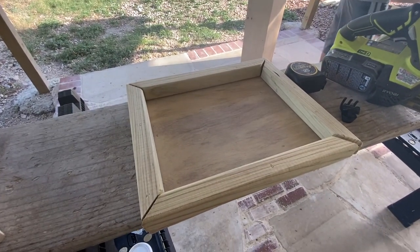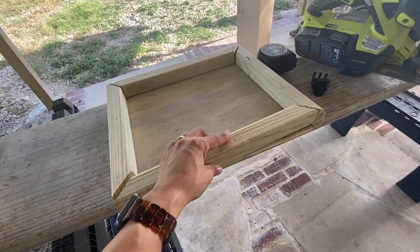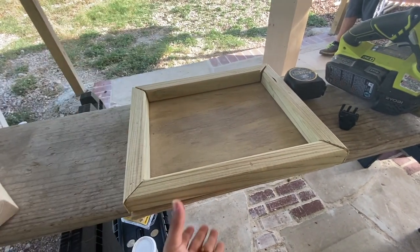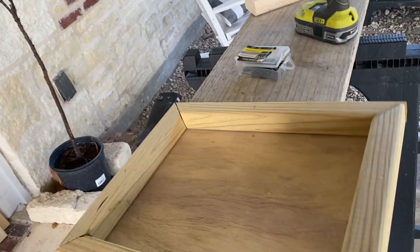This is day two of creating these wooden columns. It's obviously been a lot more difficult and complex than I originally planned, which seems to be a pattern with all my DIYs. There were a couple of changes to the base design, so I'll show you what we've been working on. We took a plywood cut at 14 and a quarter by 11 and three quarters, then found some two-by-two posts at Home Depot and cut them at 45-degree angles so they nicely border the plywood. We're going to nail these to the plywood, lay the column on top, and nail the entire piece to the bottom of the column — giving it a nice trim around the base.